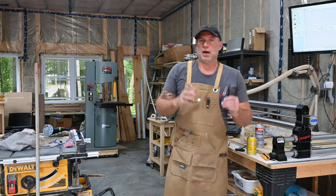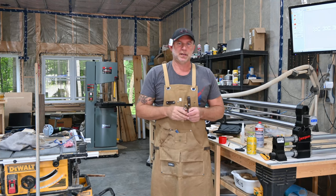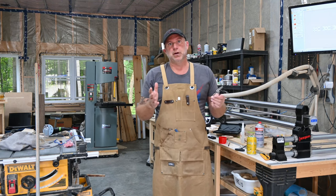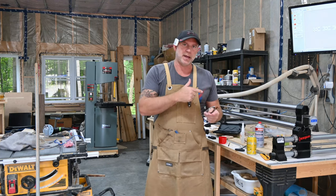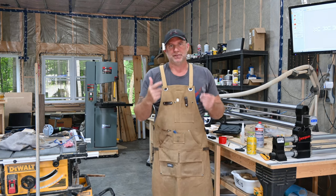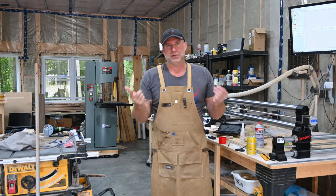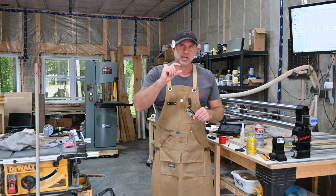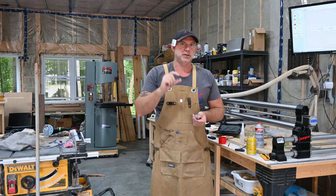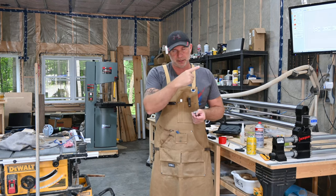If you've made it this far in the video, I'm going to give you the discount code for the Etsy store for the file. Use that code, save a few bucks, and grab yourself the file if you're interested. A few notes about the file itself: it is created for Vectric VCarve. I don't have it in Carveco, however I will provide the vectors associated with this file along with information on the depth of cut. Feeds and speeds vary based on the capability of your machine — this is a pretty beefy Onefinity, so if you've got something less capable, I'd recommend slowing those feeds and speeds down. Remember to adjust the thickness in the file and the depth of cut to suit your material. If you're using half inch, you're good to go. Anything thicker, you'll have to adjust the punch through in the different tool paths to match your material.